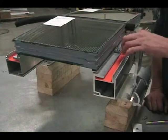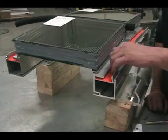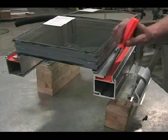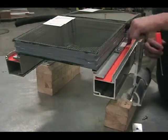You'll be able to do that before the glass. I don't think it'll be much problem, because the chair piece that kind of does the little hook and snap, if you look on page 9 and 10, is going to be flexible. The idea is it hooks here and it snaps here. And then when you bring your interior flashing in, you put zip screws in to hold it down.